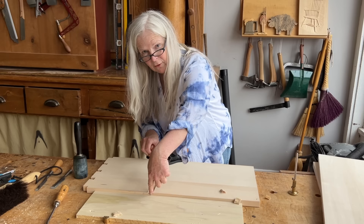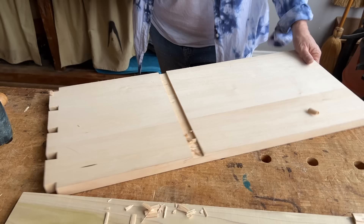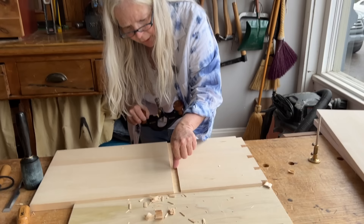Let's give it a go. Just like with the chisel, I don't want to work all the way across from one side — if I were to push all the way through, this could tear out here. Probably wouldn't show, but that would be embarrassing. So we can just push forward. I'm going to come back and just turn the blade a little to come down the sides here. And this is exactly why I don't like the clamp, because I can pick it up quickly and turn it around and finish the job.